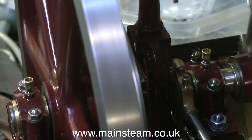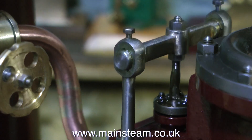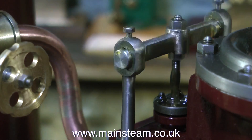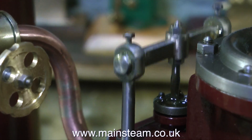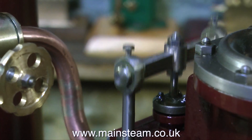It's going one-two, one-two, one-two. And after I timed the engine perfectly it sounds like this. So the engine's timed perfectly and we still have the knock at the cylinder end. But I do know what this is — that's the parallel motion that needs adjusting. So after I adjusted the parallel motion to the correct setting the engine sounds like this.